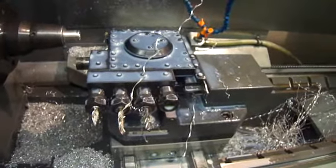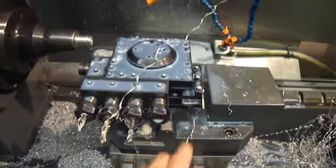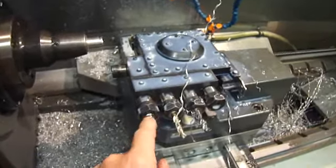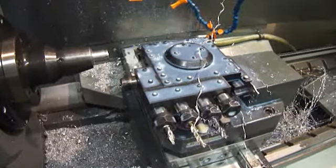This is the best position for a parting tool, but only if the parts are less than 2 inches in length. This bore extends through to the small tooling block to facilitate holding boring bars.